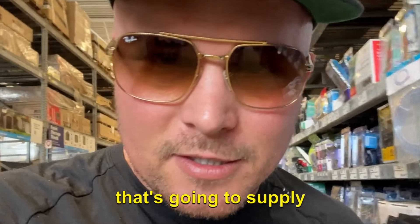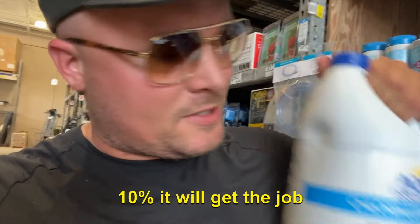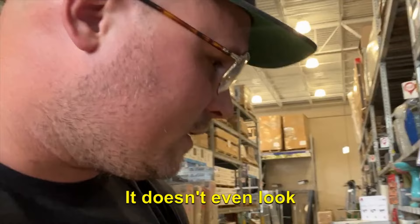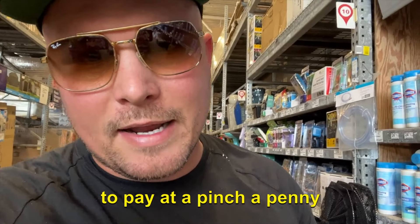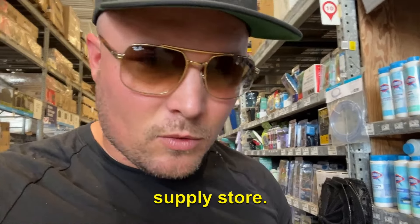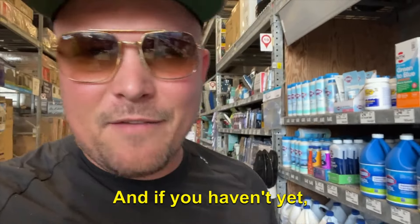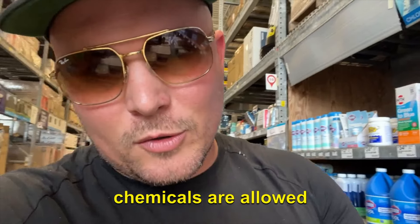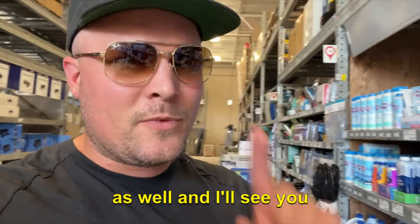At the end of the day, if you don't have a place supplying you liquid 12.5% sodium hypochlorite, I would definitely use Pool Essentials at 10% — it will get the job done. It's probably around five dollars a gallon, which is more than what you'd pay at a pro power washing supply store, but it works. I hope this video helped you out. Join the Southeast Softwash Chemical Experts group on Facebook — it's free and the link is in the description. See you in the next video.